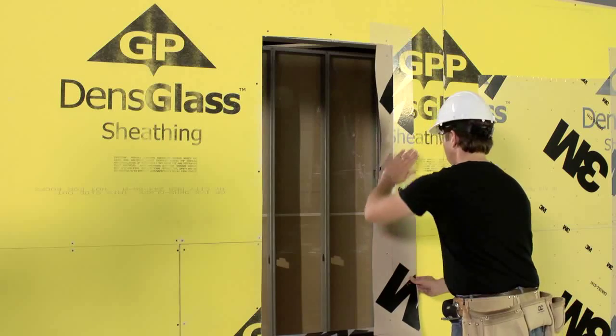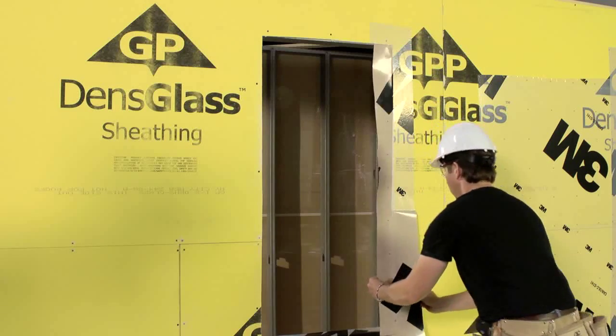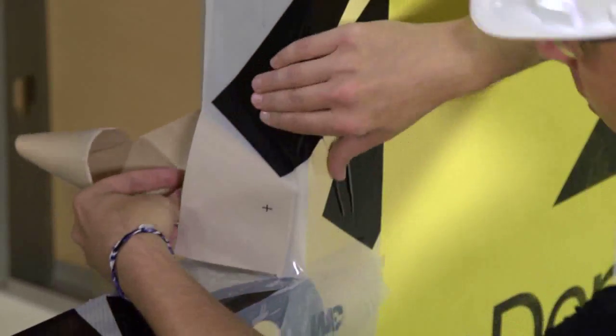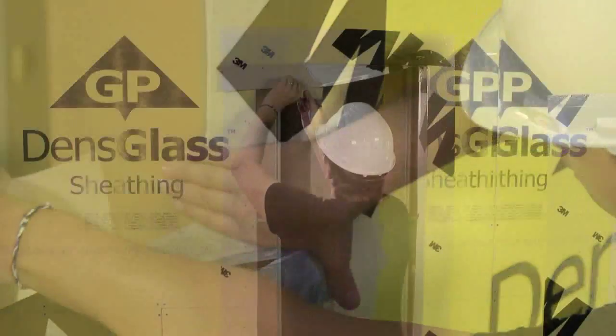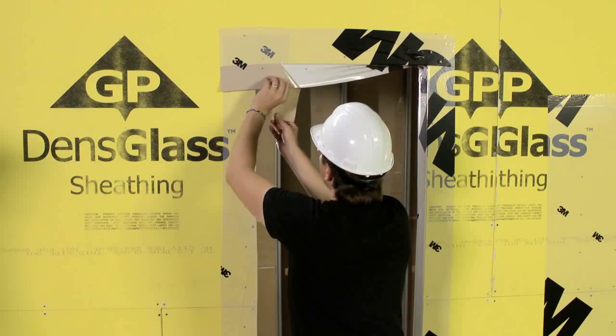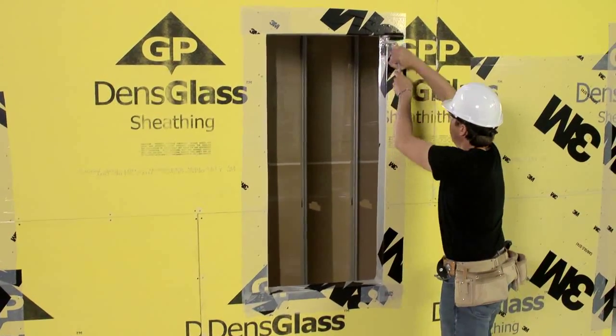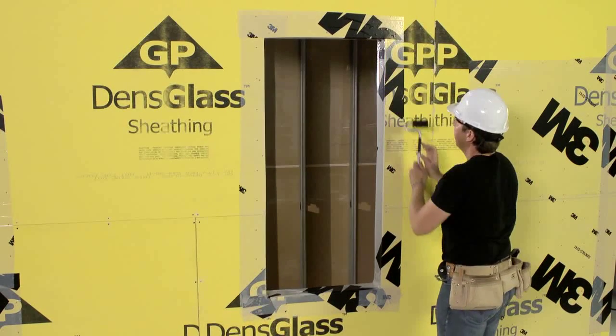Cut and apply membrane for the jambs and header with the same procedure as the sill. Start with the jambs, lapping the membrane shingle fashion over the sill wrap. Finish with the header strip lapping over the jamb strips. With a J-roller, burnish the membrane and all laps to optimize sealing.